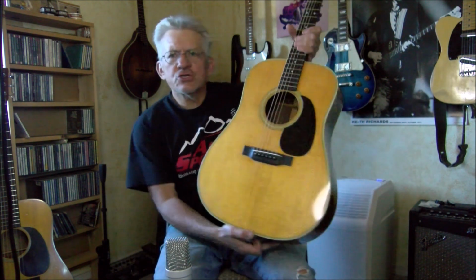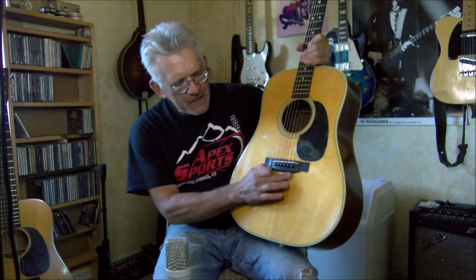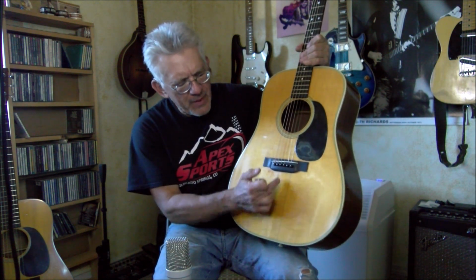There's just little things like that that make me say this is not a Sitka top. It might be an Engelmann spruce top, and maybe it wasn't quite well seasoned enough from the factory. It's dried out some. Those cracks have cleats in them. They're not any cause for concern, but it's interesting the way they're parallel right here. I think there's a weak grain line right here because those cracks are both about the same spot